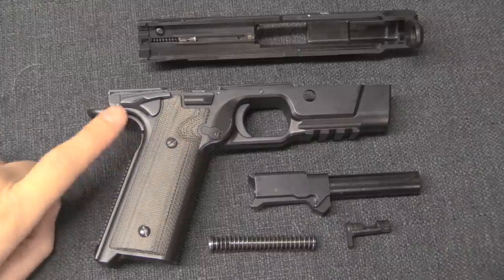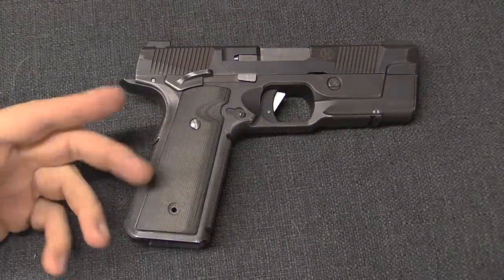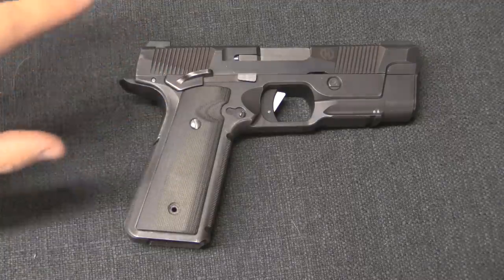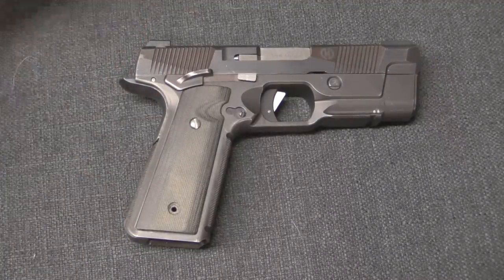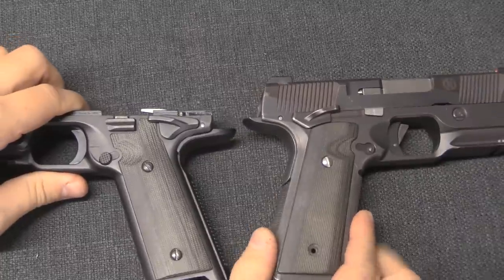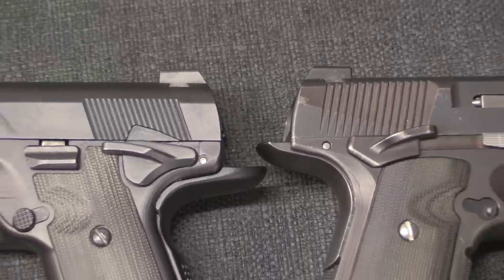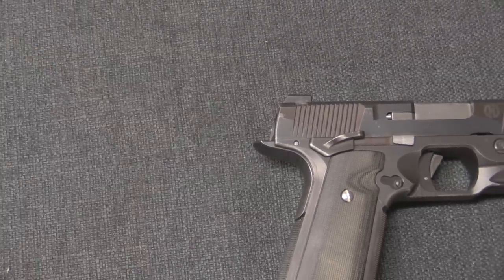This is the third iteration of the gun, and at this point I think this is the one where you got all the mechanical elements into basically their final form. Looking at the pin here and comparing it to the earlier model, you cut something like almost a quarter inch out of the height of the slide - you brought that slide down substantially. It was aggressive. We worked really hard to do that. The firearm engineers who took over the project basically said our baby's ugly - they said it was a neat, elegant, novel design. We said 'but our baby's ugly, we need to get the hand higher,' so we had to relook at the sear in order to do that.